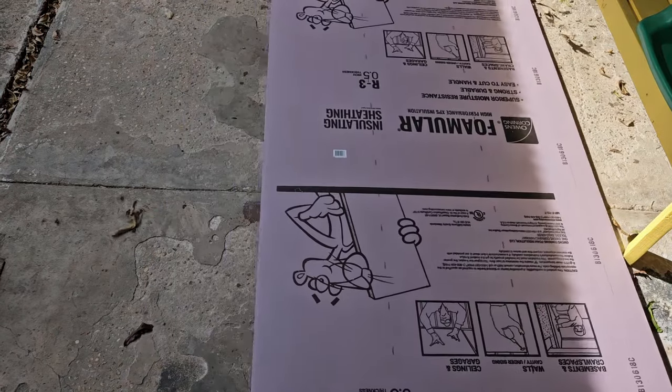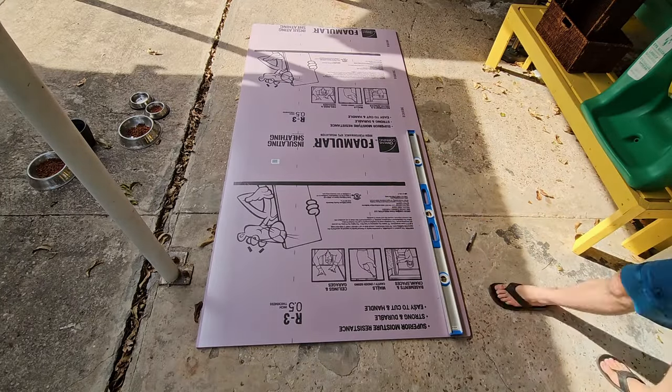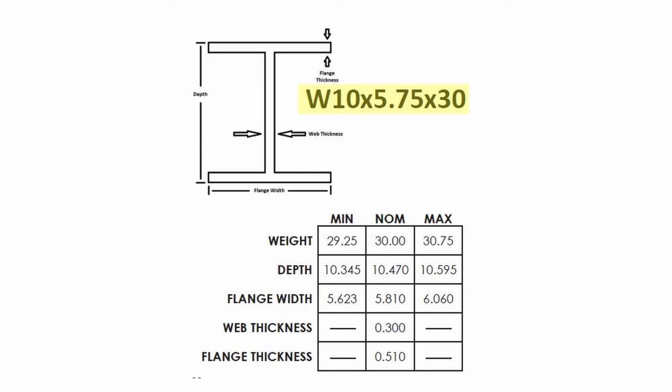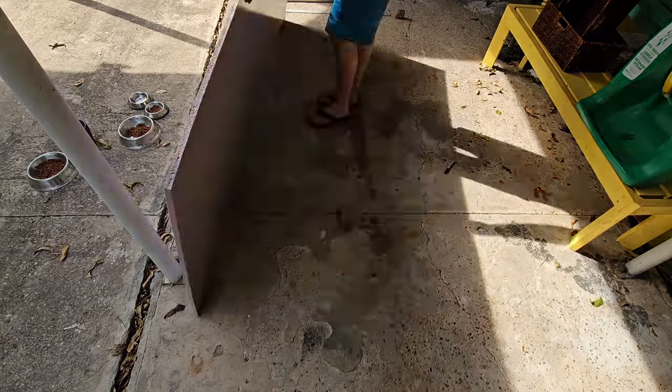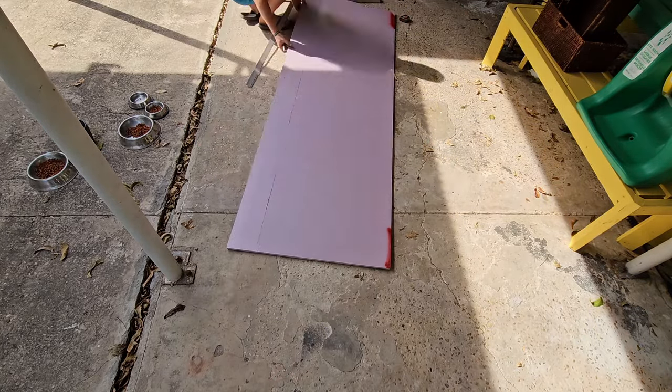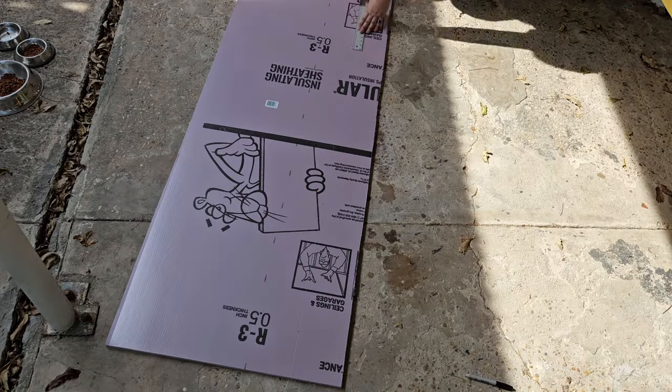The first step here is really boring — I'm just cutting stuff down to width. If you know anything about steel shapes and sizes, I'm roughly basing this off of a W10x30 with a depth of 10.5 inches, width of 5.8 inches, and a flange thickness of half an inch. Where this gets a little off track is the web thickness, which should be 0.3 inches, but since this is foam not steel, I need that extra thickness to support it. Also, 0.3 inch foam doesn't exist. So there.